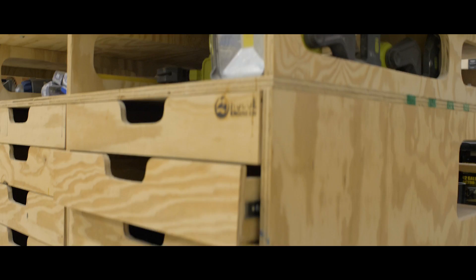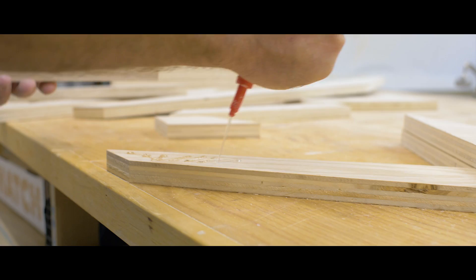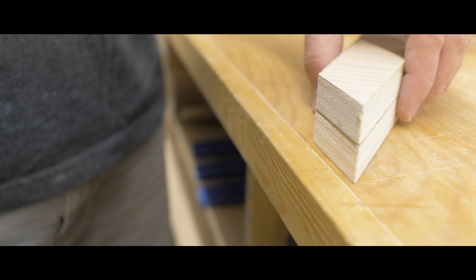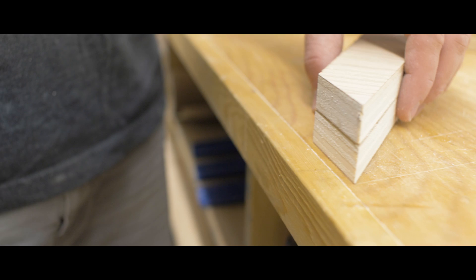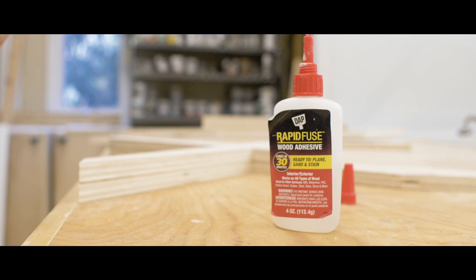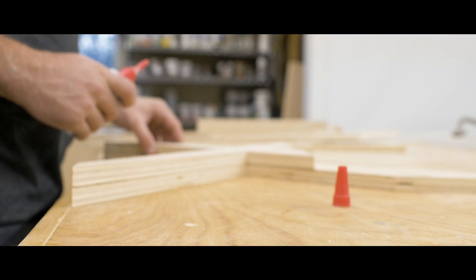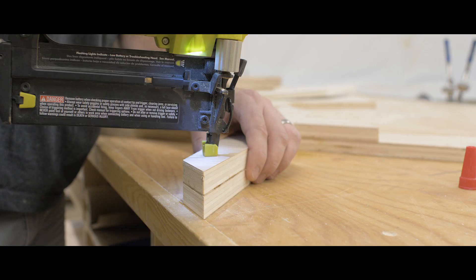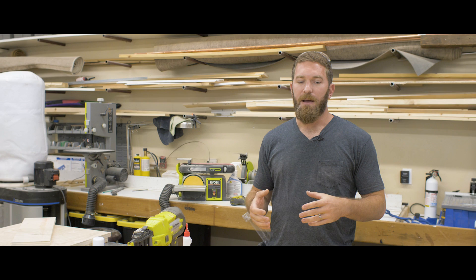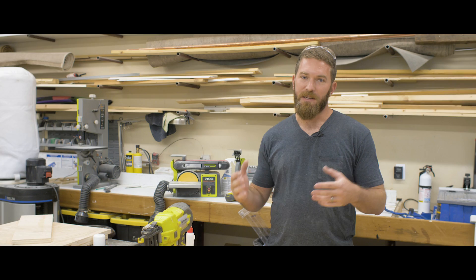Now that all the pieces are cut, we can start putting the sides together. I'll lay out all the pieces as they should go to create this half lap X side. I'll use the edge of my workbench as a surface to rule from for the bottom of the feet. Once everything is aligned and the joints are as tight as I can get them, I'll pull each top piece off and glue them together. I'm using Rapid Fuse, a quick-setting adhesive, and one and a quarter inch brad nails to hold everything while it dries — it'll dry in minutes versus hours, so we can keep moving.